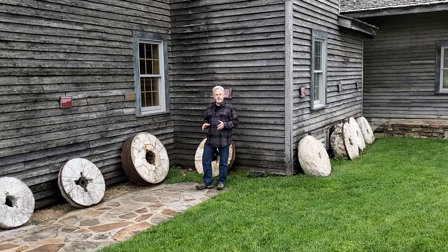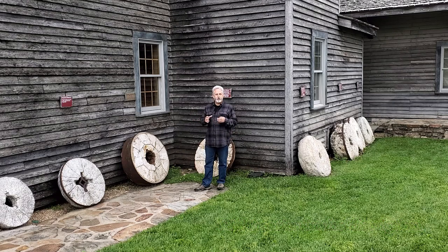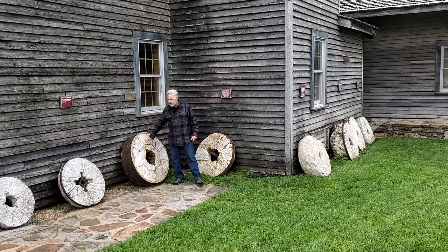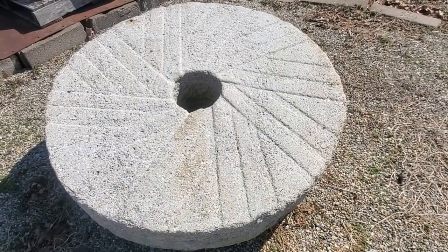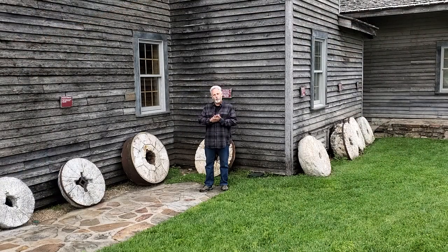Here at Edwards Mill, they have a nice collection of millstones. I always like to stop and take a look at these because they change throughout the years. There are various sizes represented here and various stages of completion as well. These were a modular type and then they had solid type. They all have grooves cut in them, and those grooves had to be maintained from time to time — recut as the millstone wore down. Those grooves are what moves the kernels around inside the mill so that they can be ground and pulverized.